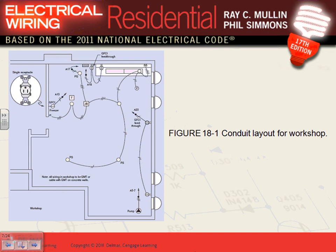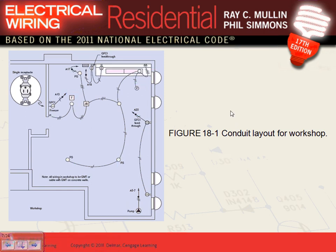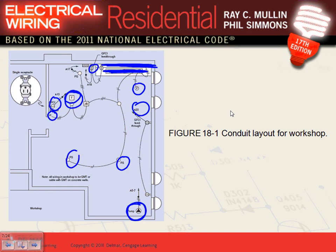Again, all you really need is one receptacle, but obviously if you have a sump pump you need one for it, a freezer needs one — dedicated or plugged from a multi-outlet assembly. Now when you're wiring in the basement because it's concrete, you can't put NM cable directly against the concrete. The conduit of choice in residential is EMT or PVC — many people use EMT.